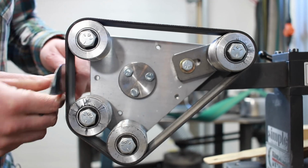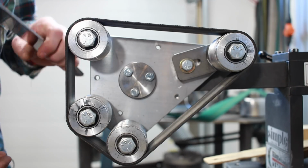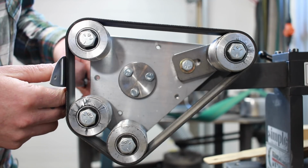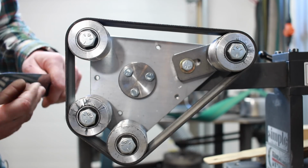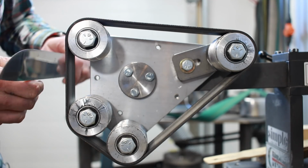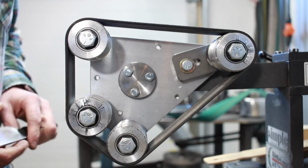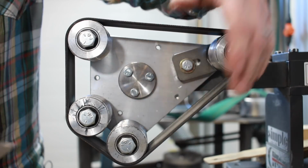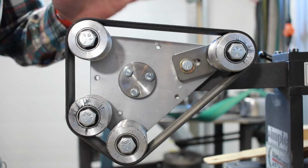Like that still moves a little bit, and you still get that convex grind, that curvature on the bevel, but it's still very controllable. Every tiny little input translates to the grind itself. If you're just using a belt between your platen wheels, you can't get a lot of pressure on it. Obviously these different distances between the wheels do vary slightly, although it's very little.